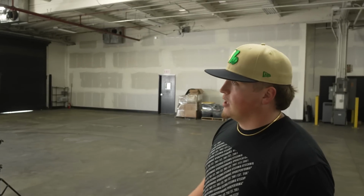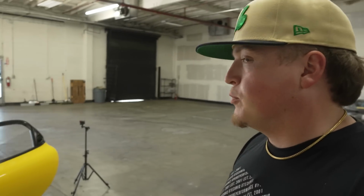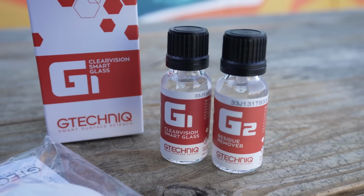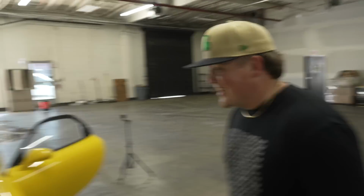All right, up next is something I haven't personally done yet, and probably something we all overlook. Window coating? Yes, window coatings are actually very cool. A lot of times when people put glass coatings on their windshields, you don't actually use your windshield wipers anymore. The coating we're putting on now has a 40-mile-an-hour speed barrier, where essentially if you go 40 miles an hour or more, the water's going to sheet off. So I don't ever use my windshield wipers anymore. Some people do a windshield wiper delete, as funny as that sounds. I come from the Volkswagen world. That's common to do to make your car look nicer.